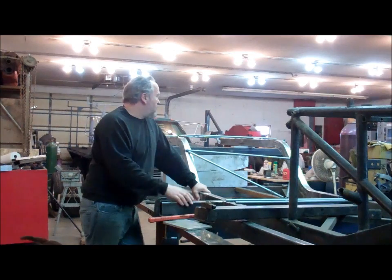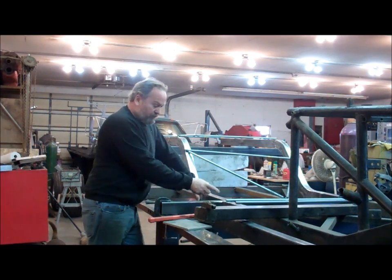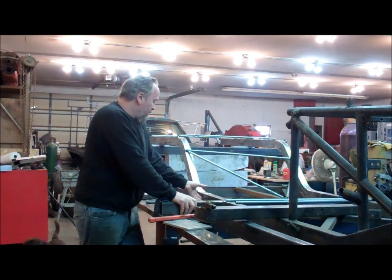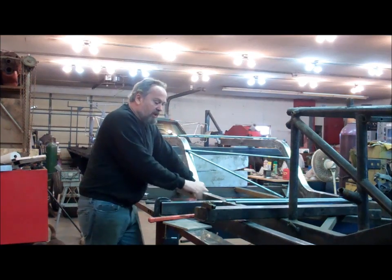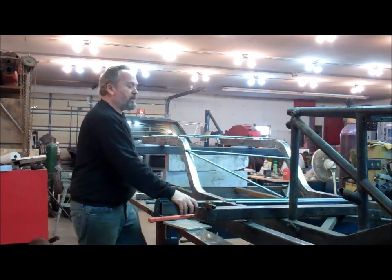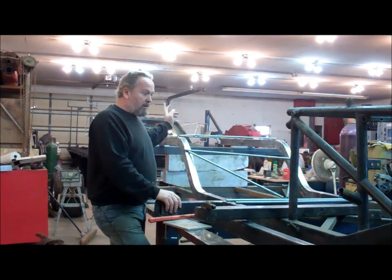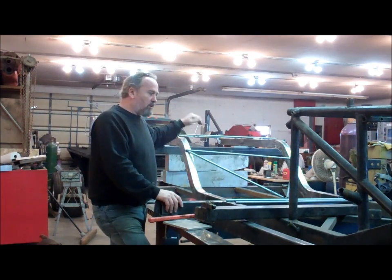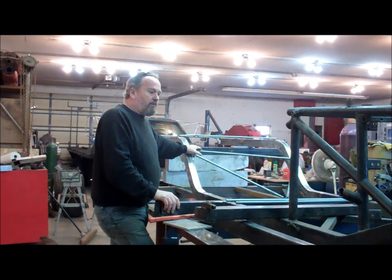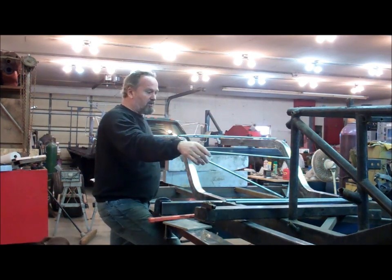Alright, so I've cut the frame in half, added about 13 inches in the center here. Give her a gusset in here and stiffen that back up where we cut it. Blend it from here to here, here to here. And then we're waiting on roll cage tube and then some cross member materials. Put in the cross members, and then we'll start with the back hoop. We'll tie this in here. And then the idea is, we'll have the front hoop and the front cross member in.